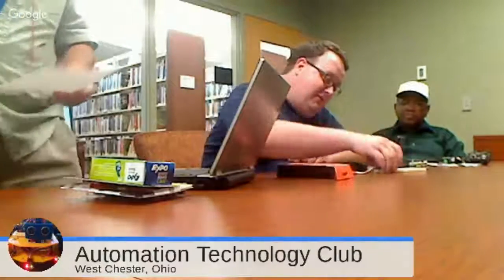Okay, well, you got something for us tonight, Will? I did, and I totally blew it. But basically, what I did was create a generic chronograph using infrared. When I first set it, I have it at about 4 inches here. And then within the code, I have it divided by 3333, and I have it down in milliseconds. And that will tell me what the feet per second is of whatever projectile is shot through it.